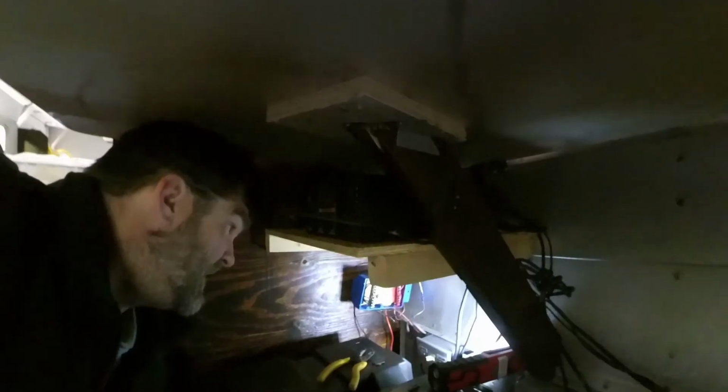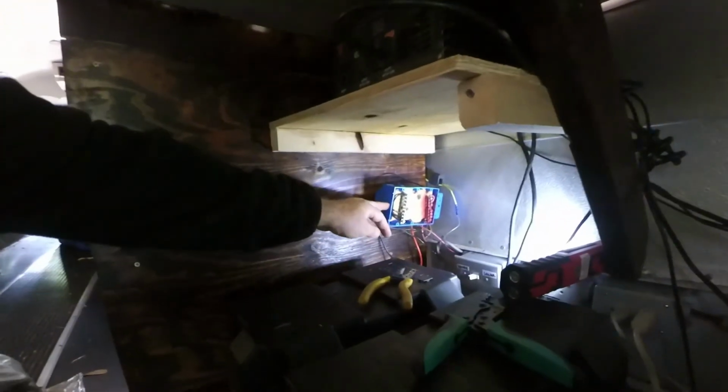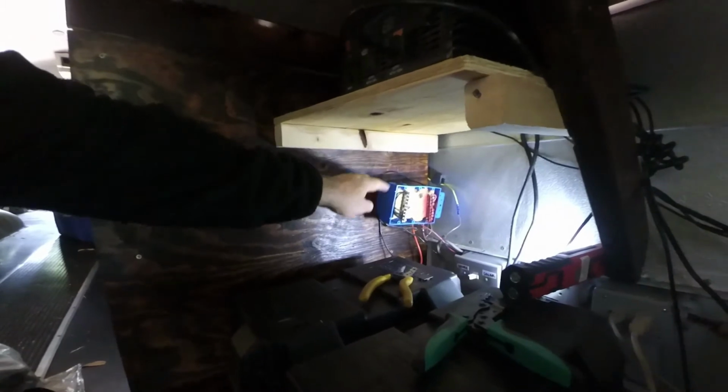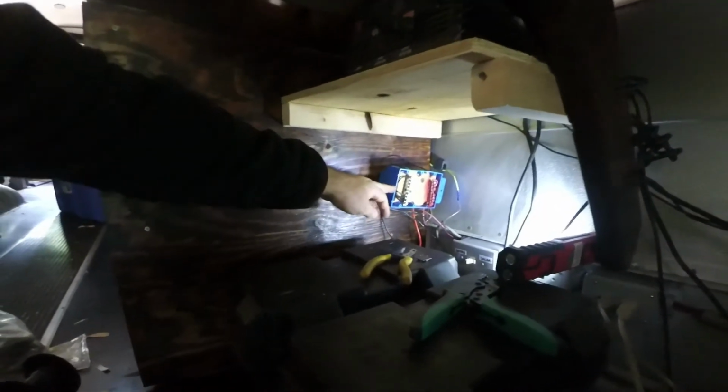But let me show you a little bit about my electrical install. The really redneck wiring, DC and AC. Of course, I've got the batteries right here. I've got two deep cycle batteries, and they're running through the DC board here. I've got the charging system running through here and then into the batteries, and it's basically backfed back into the DC board.